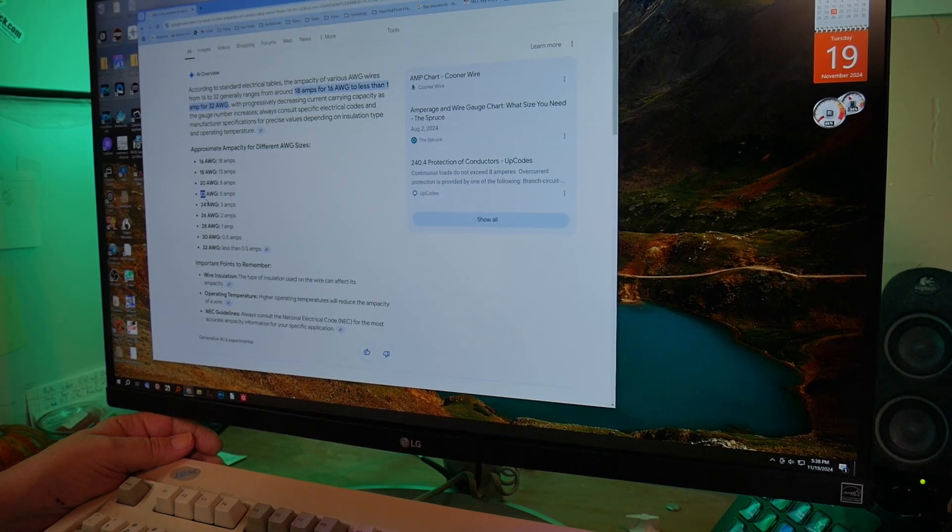Let me tell you that your coax is a lot better than that. According to the tables I found at DX Engineering, RG8X — which is a very common, highly used cable that I like a lot myself — has a center conductor that's 16 AWG, which can handle up to 15 amps. So 15 amps compared to about 1.414 amps — you've got no problem. You're not going to get heating in the cable. If you go up to 1,000 watts, then you buy something more. One thing to remember about RG8X: it's primarily for HF. It has a lot of loss at VHF and UHF, and you might want to look at a different conductor like LMR400 or something like that.